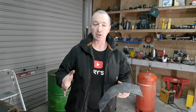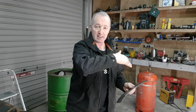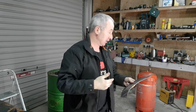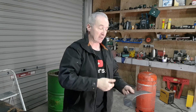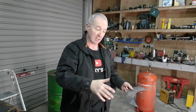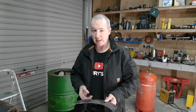I'm just putting the jacket on so I can weld. I've cut a few of these pieces — the arc on the inside is good enough for the tank, but on the outside it's wrong because I just kept staggering them along. What I'll do is put it on, mark around them, go round with the jigsaw and that'll do it. That gives me essentially a big washer around the propane tank and that's going to work as a seal to get it airtight.